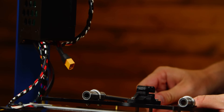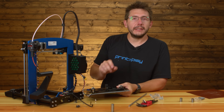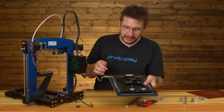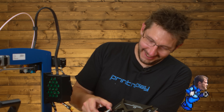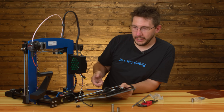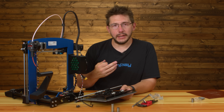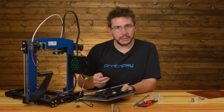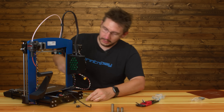I'm going to put the smooth rod in. Now that the new bearing is attached, I just want to see if there's wiggle — there's just like a micrometer of wiggle compared to the last one. One of the things you can do when putting the smooth rod into the bearing is check if it slides smoothly or freely. This one has a nice easy motion to it, whereas if it was too tight it could be stopping along the way.